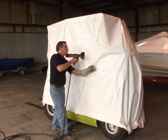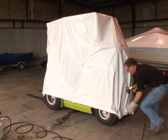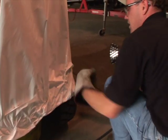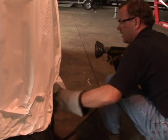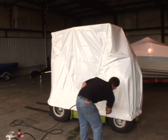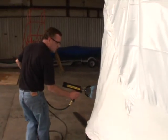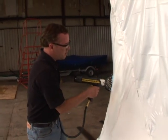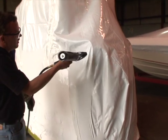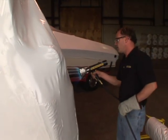You can see Lance doing the pleats and inserting heat in between the layers, starting always at the bottom and then working towards the top — let the heat work for you. Lance is almost done doing the last corner, and then the entire unit can be shrunk. Lance is starting low and letting the heat work for him, and you can see how it tightens up very quickly.